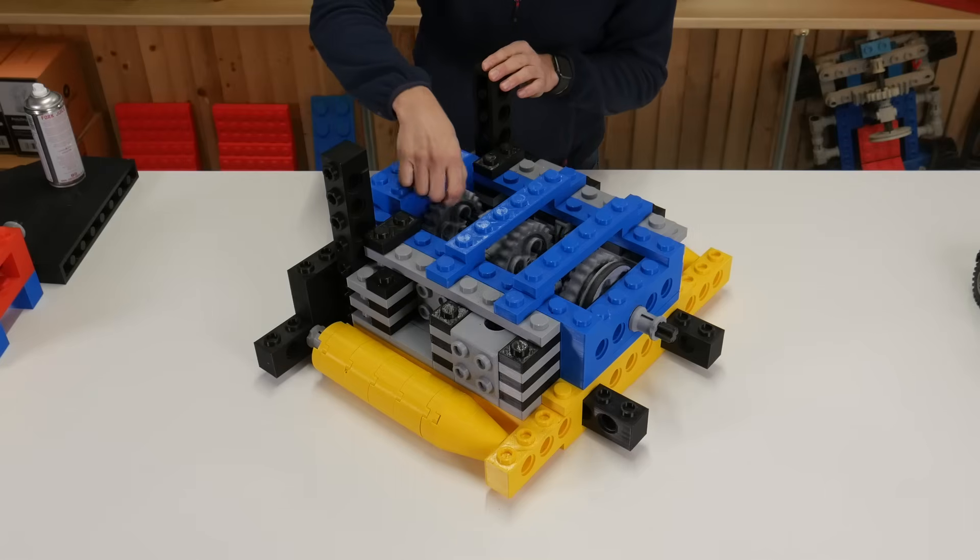Oops, I should have passed these hoses underneath the fan — let's remount that properly. Time to fit the belt. You'll notice that I'm putting a twist in the belt; without the twist it tends to ride off either the bottom pulley or the top pulley. That feels like it's running nice and smoothly, so why don't we add an electric motor to it.